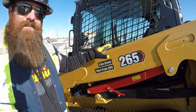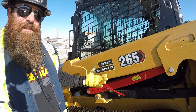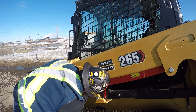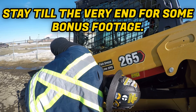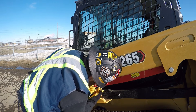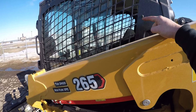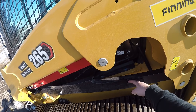There's no reason you need two people — make sure that you use the safety brace. Keep yourself safe. When you're all said and done, you're just gonna pin it back up, just like that. You're all done, ready to go back to work. One thing I like to do is crack this back window just a tiny little bit so that I can hear when all this stuff clicks and falls into place — that way I know that I'm over the top of this pocket and I'm good to let the loader down.